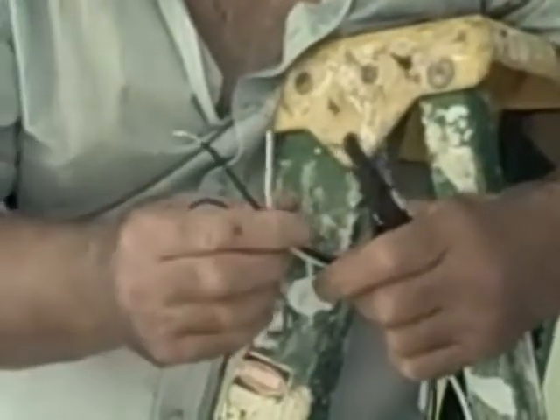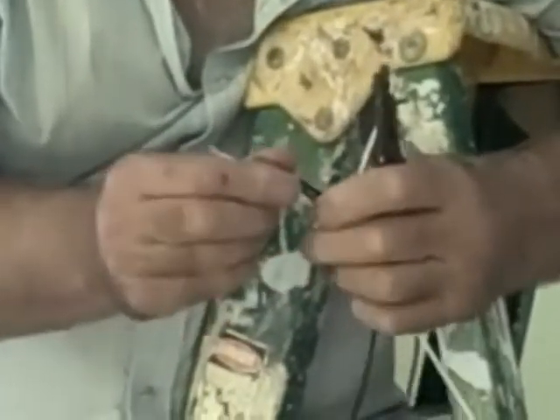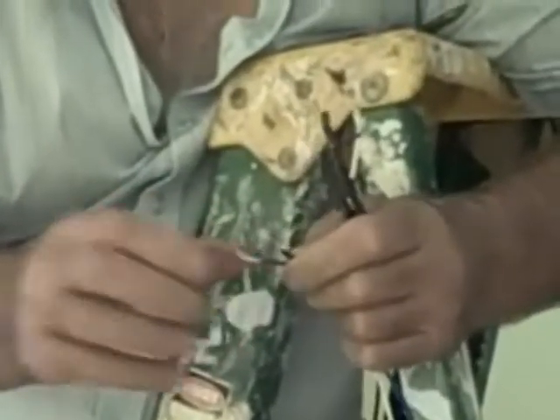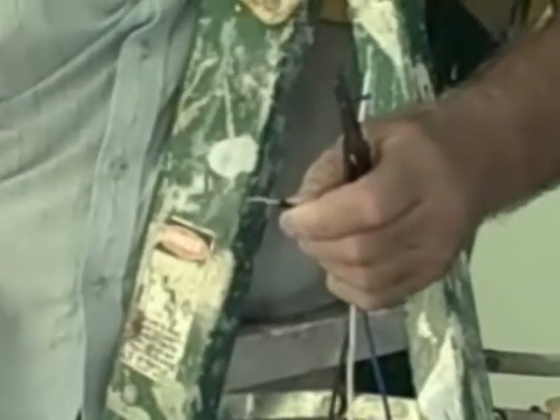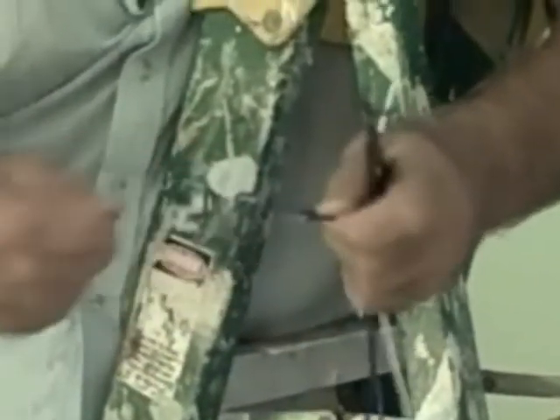My ends up above on the remote are already stripped. Because it's hard to see up there, I'll be putting the light colors together. What you want to make sure before you put the wire nut on is that you twist the wires together — see how I did that? Up above I'm going to do what? Blue to blue, black to black, and white to white.